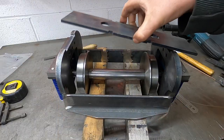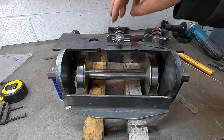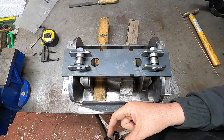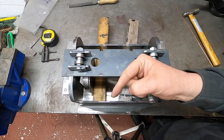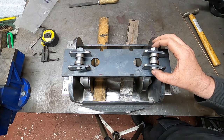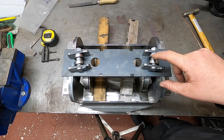Back to the video. So this plate goes on here, like so. Then I might cut it down. So these lovely little contraptions that we've made are to go here. And here we have the bird's eye view looking down. This piece here is the front of the loco, which is an arm which comes along and welds to this, which comes from the pivot point on the floor of the chassis, which means that this whole section rotates. So these don't want to be 90 degrees on this plate. No, these need twisting like so. And not only that, because we have limited space between the plate and the plate on the bottom of the chassis, these need to sink in.